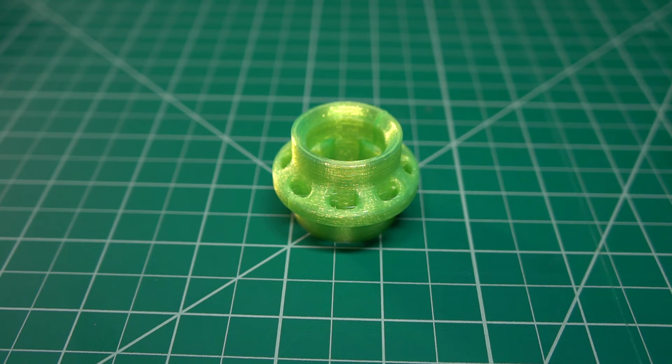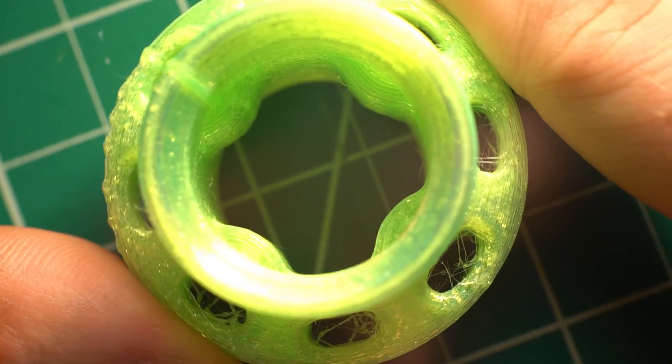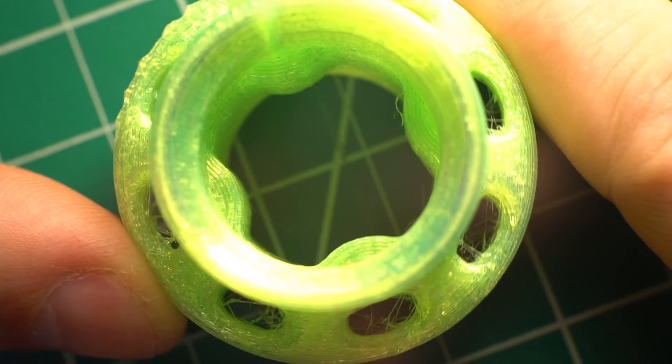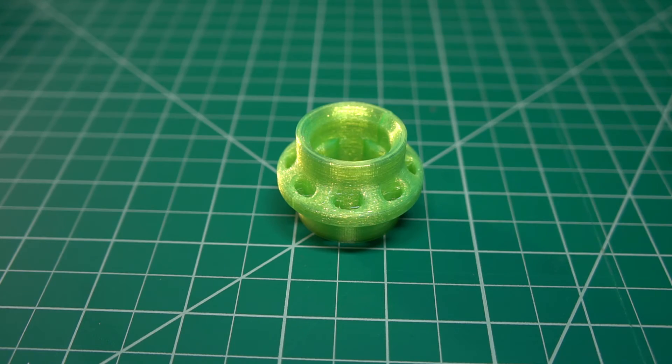Here's version 5. I redesigned the retaining ring once again and decreased the size of the four waves in the bearing seat. What you can't really see here is that I did a ton of super specific optimization for 3D printing. The standard stock nozzle on almost every 3D printer out there is 0.4mm, and almost every dimension in this version of the core is some multiple of 0.4mm. That means if you print this part with a 0.4mm line width, 7 walls, and no infill, you will get a perfect solid part that has the absolute minimal number of retractions. That made a huge impact on print quality, but I still wasn't 100% happy with it.